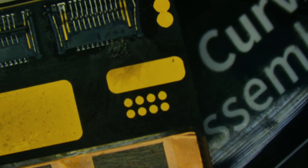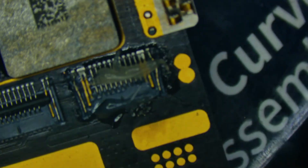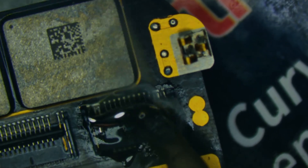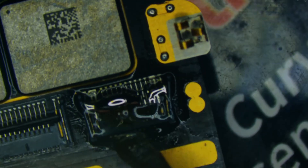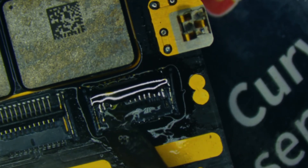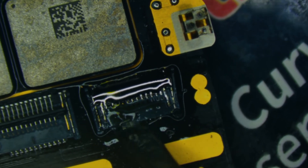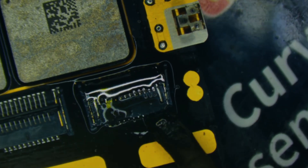I'm going to isolate the back of the display with a spacer, and I'm going to add some flux to the top of the connector. I'm going to come in with my soldering iron and flood the pins with solder, doing the same on all the pins, making sure to mix this low-melt solder with the factory solder. This will make it so much easier to remove in a second.